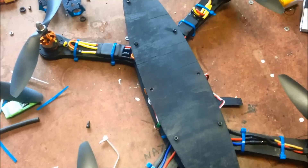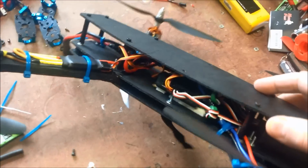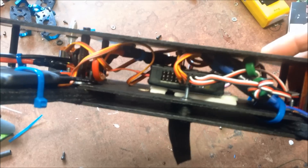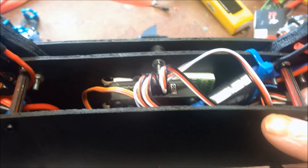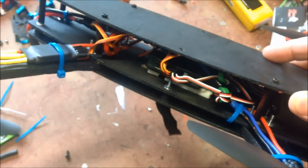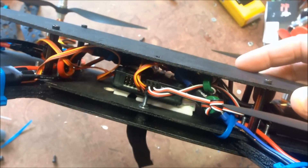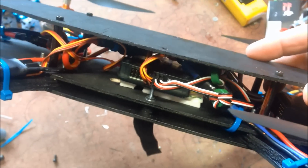I need to do one more thing to finish up my ZMR430. The KK is sitting facing the front, and this is the hard case version, so the cables come out the sides. My central mounts for the frame couldn't be used because they interfere with the cables. The latest version of RC911's firmware for the KK allows you to rotate it 90 degrees so the cables come out the front and back. I'm going to do that and walk you through it.